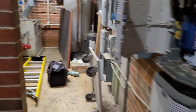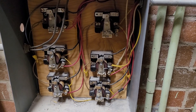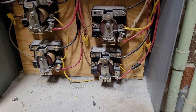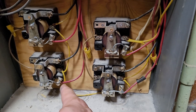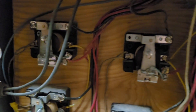All these thermostats started to come back to life. I could have just bypassed these relays — and that's probably a better long-term solution since they're not needed. The way you bypass them is to connect red with black: the red is the common terminal, the black is the normally open terminal, and the terminal on top is the normally closed terminal.